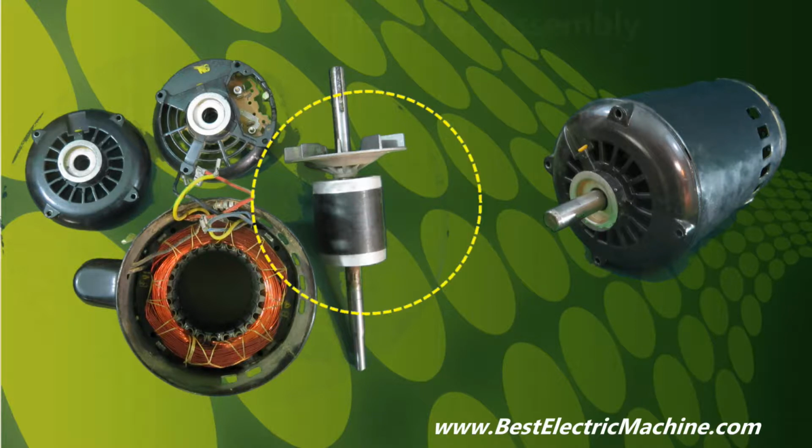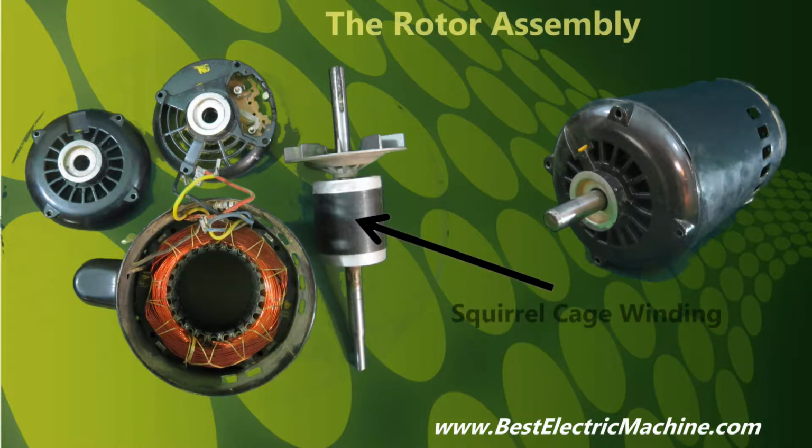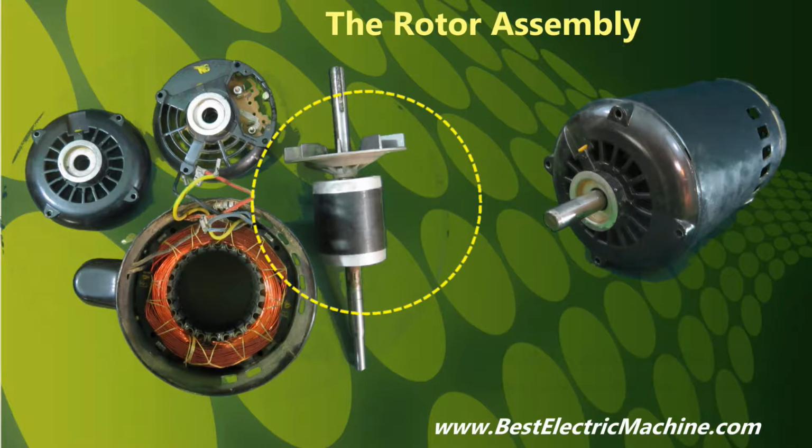Second component, the rotor, or rotating assembly, which for this standard induction electric motor example, includes the so-called squirrel cage winding set. Without an independent, bidirectional, multi-phase electrical power connection to the terminals of the squirrel cage winding set, the cost, size, and electrical loss for a rotating electrical connection means are conveniently eliminated, but unlike the stator, the rotor cannot actively contribute electrical power to the electromechanical conversion process.